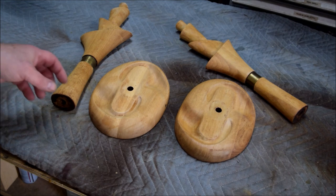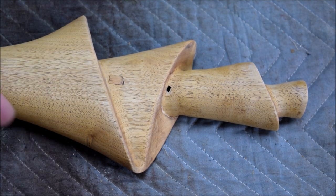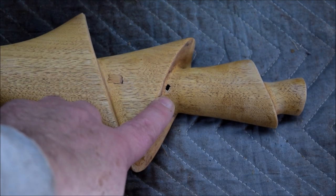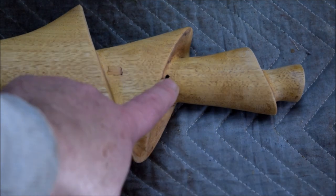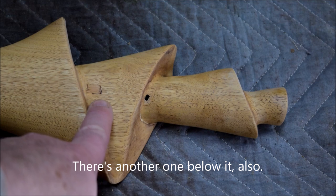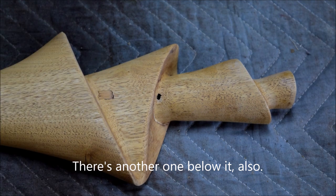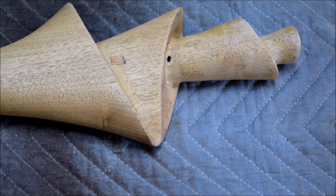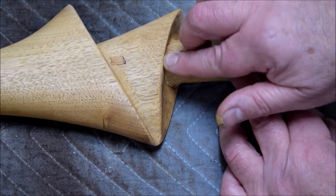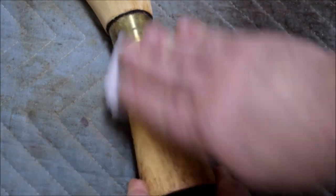A couple of interesting things to show you on this piece: it has a hollow body and it's a turned piece. Right there, whoever turned it went a little deep and went right through, so we're going to try to put some epoxy in that and close it up. And right there is a factory patch where they went through as well. I'll take care of these and put a little colored toner on this — going just a little bit darker than existing with the epoxy putty. The next step is just to sand it with some 150.